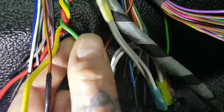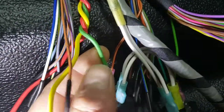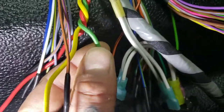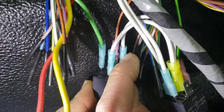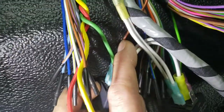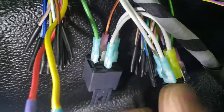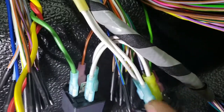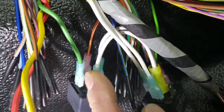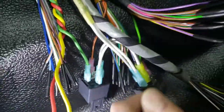So we have this green wire that's from our purple pass-through wire — this is hot when our clutch pump switch is on. When we turn the clutch pump on, this activates the coil to send the ground to our PTO VSIM, therefore the switch will stay on. But as soon as this reaches 25 miles an hour or over, it will activate this coil, taking this ground away, which will then kill the switch. That's how you do it there — the gray is used for other things we won't cover right now. From the black it's our light green, from the brown plug it's our orange-brown.